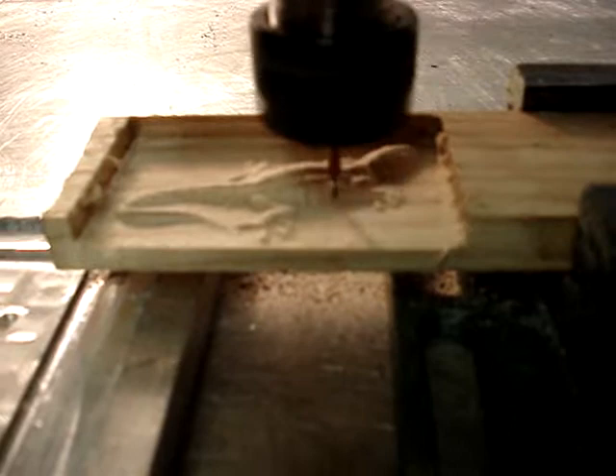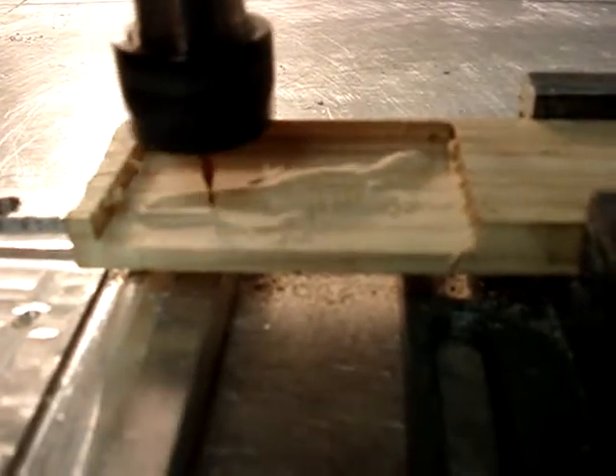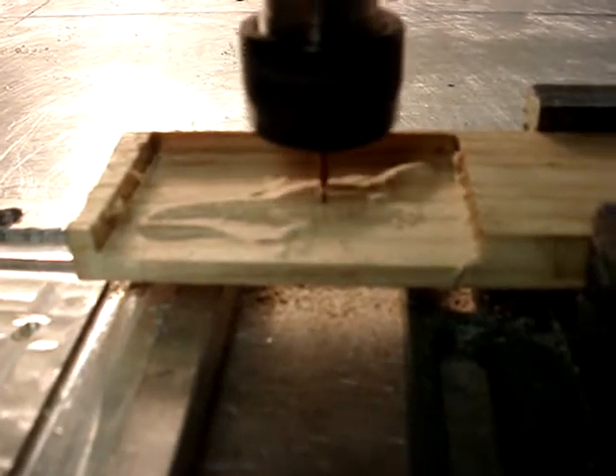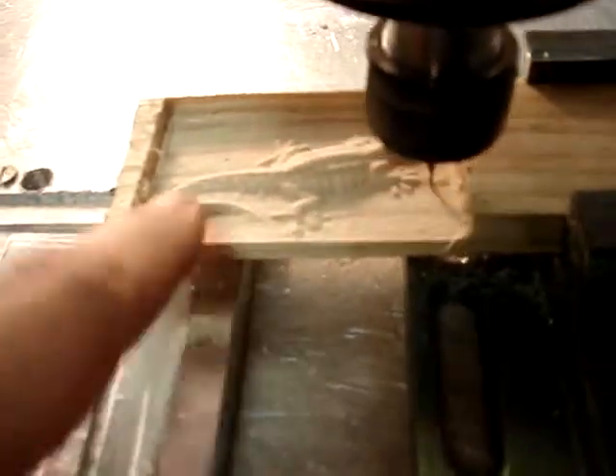So I've already processed it. This is my third pass. I did a roughing pass with a quarter inch end mill, and then I did a relatively smooth pass with a 1/8 inch ball end mill. And then I have a 0.05 inch ball end mill, and I'm stepping over only 10% of that 0.05 to get fine detail. Usually I haven't rastered X and Y, but this output is pretty damn smooth.